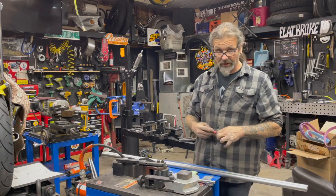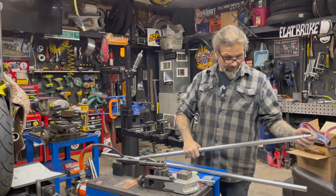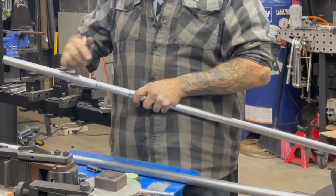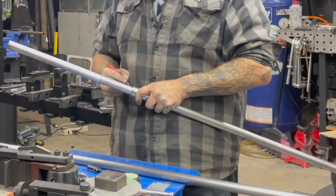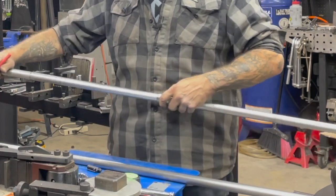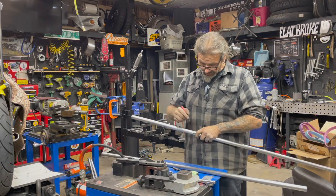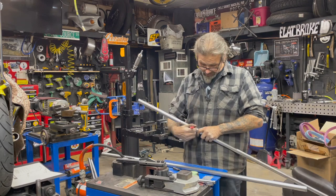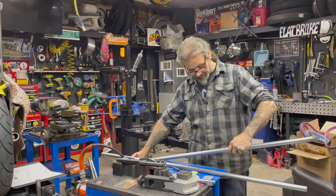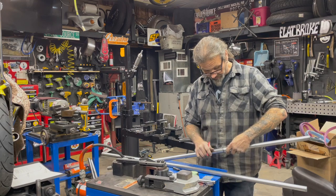Here's a great little trick that Will Ramsey taught me — a little piece of tubing that has the same ID as the OD of the tubing we're working with. This is a great way to transfer your marks around the radius. The reason this is important is that as we move down the tubing for the different bends, some of them are 90 degrees and some are 180 degrees off center, so you don't want to have to mess around when you get to that point. It's just as easy to do it right from the start.